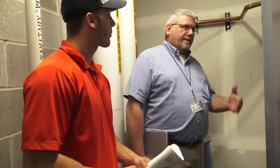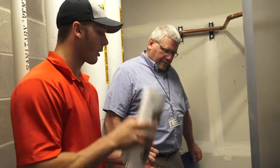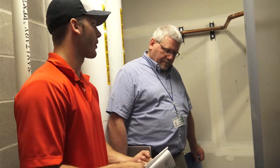And I suppose it's normally a year that you'd run that at. Since this thing isn't going to run very often, would it still be a yearly thing, or could it go out further than that? It could potentially go farther than that. I guess you could base it off of runtime hours. Definitely combustion analysis once a year. Every winter, before every heating season, I would have somebody come in and do combustion analysis.